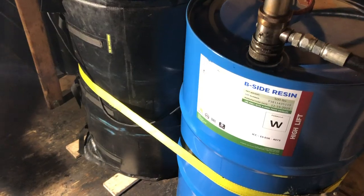Also underneath the barrel, you can see 1x2s that we put underneath. The whole idea is to get that barrel off the ground when you're driving, especially in the morning. It gives it a little bit of an air gap so as heat moves around the trailer, it makes it less likely that the bottom of your barrel is going to get too cold. If you're experiencing problems with your application when it gets below 30 degrees, make sure to check the temperature of the barrel and make sure your barrel is off the ground — it's going to make a world of difference and it's pretty cheap.